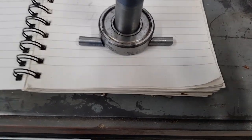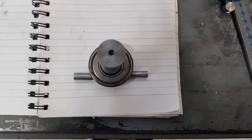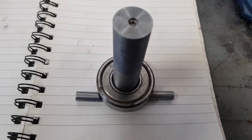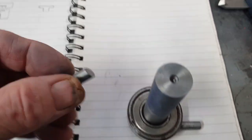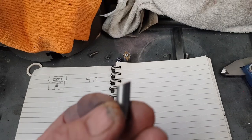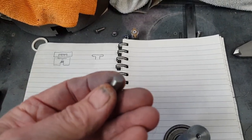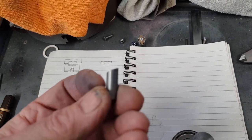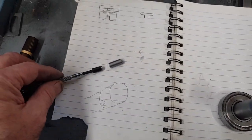The little slugs are finished. You can see that's roughly where they go on a Super Seven cross slide where the compound fits. Those slugs are at a different angle to the ones already in there. I've taken a piece of threaded bar, turned it down, and filed the angle on them. The reason I've used steel is because I've got little magnetic tools and they'll be easy to pull out.